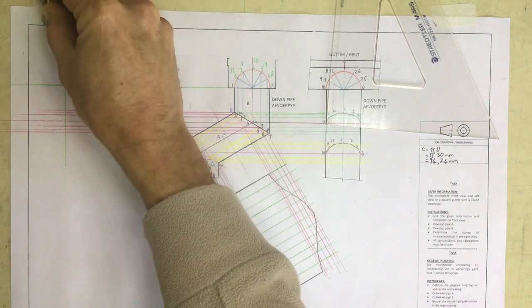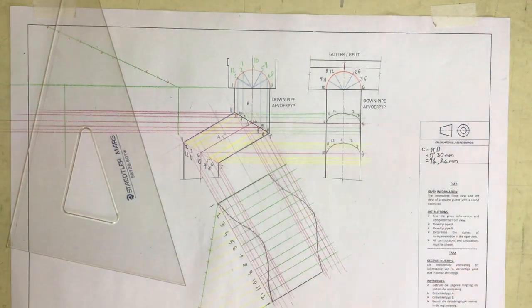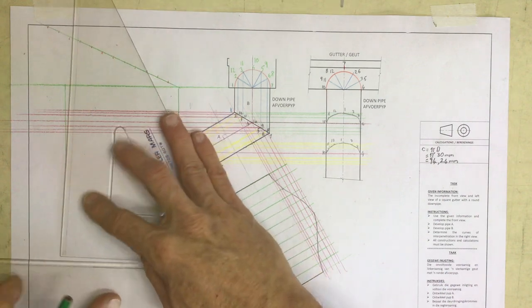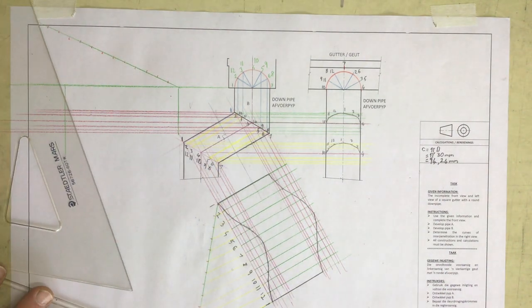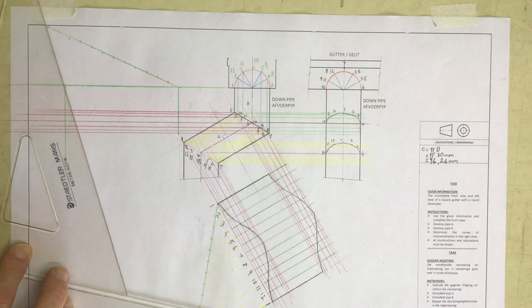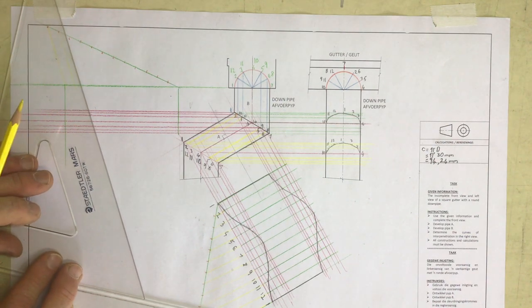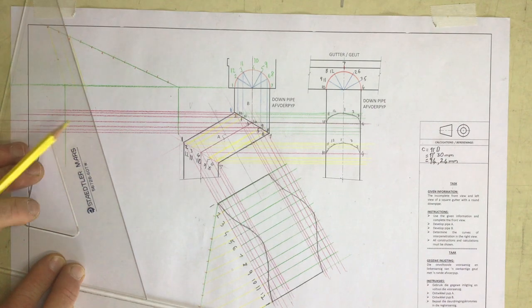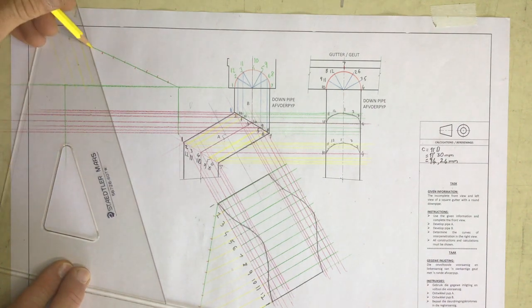1, 2, 3, 4, 5, 6, 7, 8, 9, 10, 11, and 12. Please use very sharp compasses for that so that you get them in the right place. Link that up with this over here. There's the line at the back there. And ta-da. Right. Draw lines parallel to each other coming from those points, breaking up my line beautifully into its 12 equal portions.